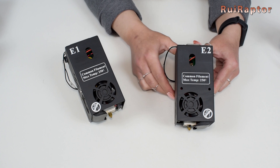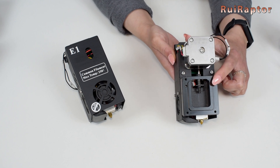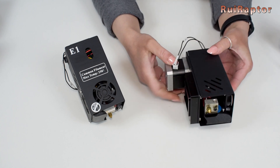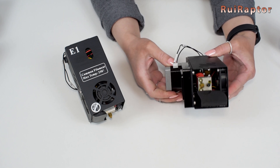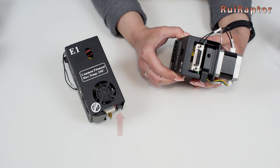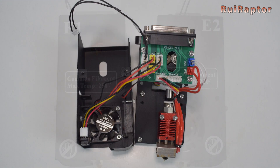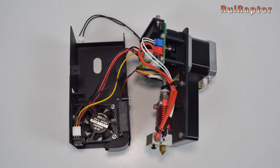These are the two common filament heads. The second head is equipped with a manual nozzle height adjustment so we can match with the nozzle from the first head. They can print together or individually, and were designed for filaments like PLA because of the PTFE tube-lined heat break inside. The first head is basically the same, however it includes the optical leveling sensor near the nozzle. On the enclosure it states the max temperature is 250 degrees C, however to avoid damaging the PTFE lining inside the heat break, we recommend not using temperatures above 240 degrees C.